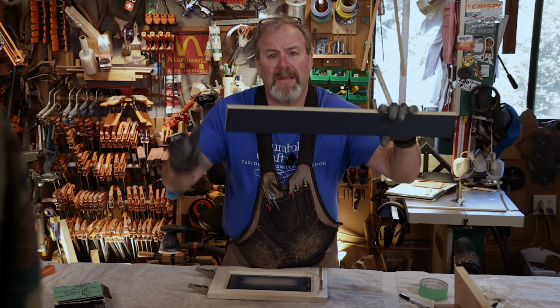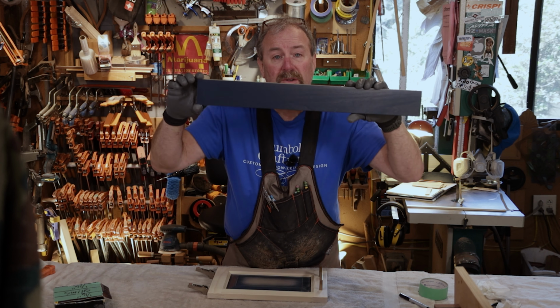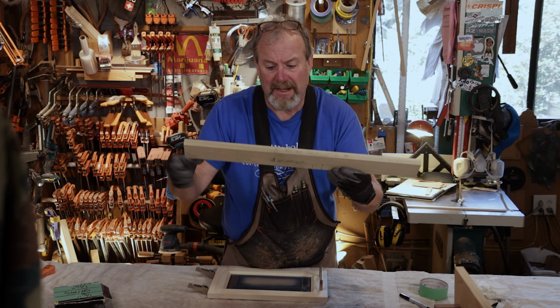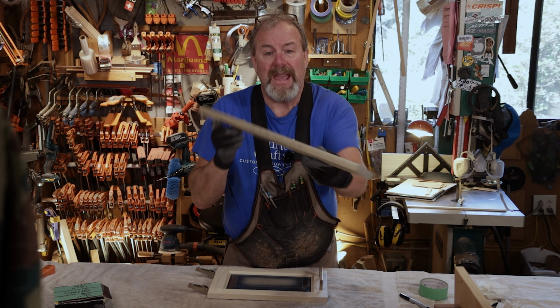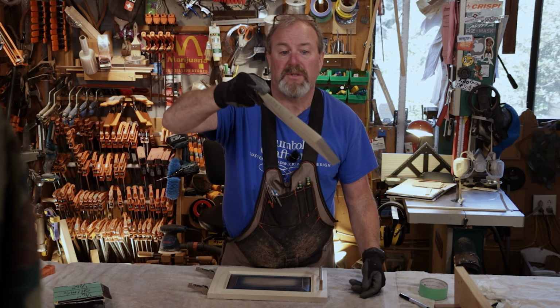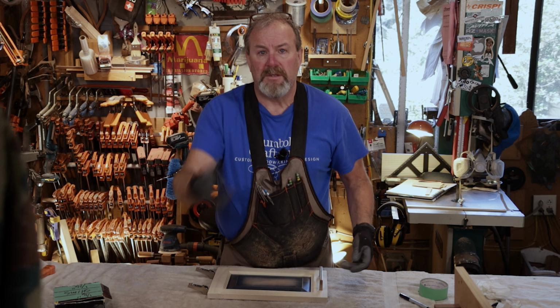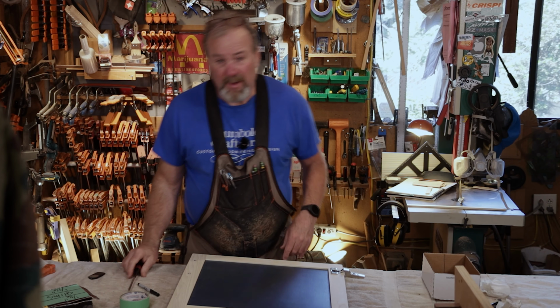If you have a 3-inch toe kick, make your toe kicks 1/8 of an inch smaller, so you can just slide right in after the whole thing's installed without having to force it in there, because that's another good thing. And when they're beveled like this, you can also slide them into place much easier because it's not square. Toe kicks. So I'm going to go over something right here.